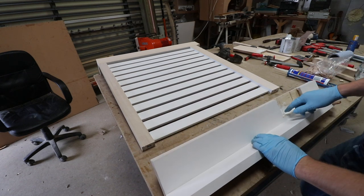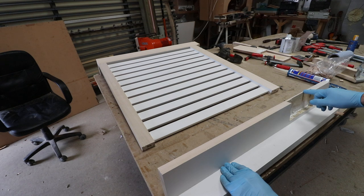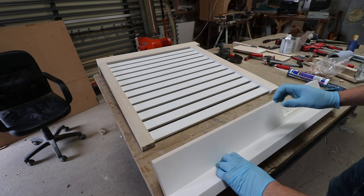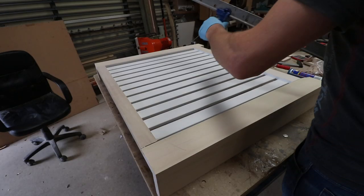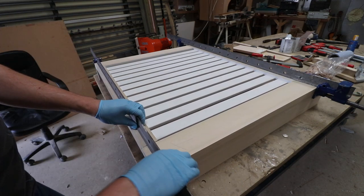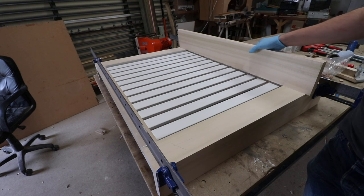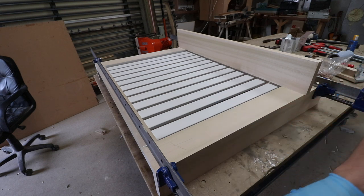I've done a bit of a notch out here — it's a bit rough, cut it out with a multi-tool — but that will notch over where the valve sticks out the side of the radiator. I haven't got a lot of room between the nested tables I've decided to put next to it, so I've set down to about 5mm, which is as thin as I'd go. There's about a 10mm gap, so it should give us plenty of clearance between the valve and the tables. Whenever you're setting clamps on, make sure they're parallel along the piece you're clamping so it doesn't try to pull it out of square. I'm going to run a straight edge over the length of the uprights to make sure they're staying flat and not tipping either way, because that's going to look awful against the shadow gap.